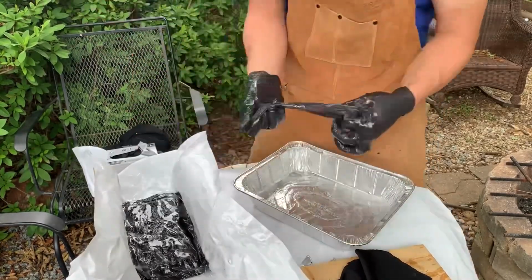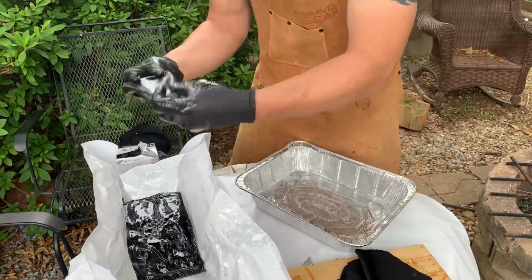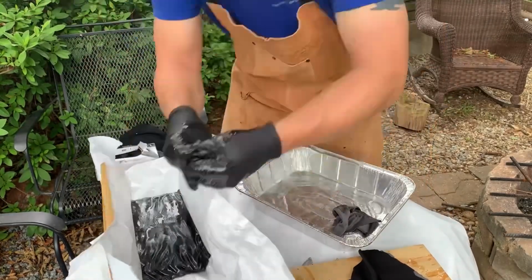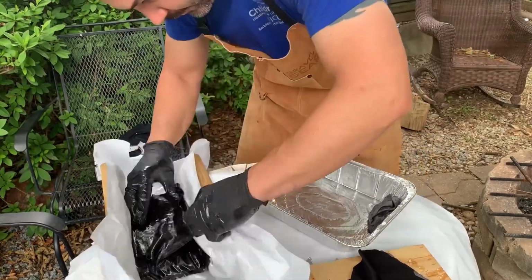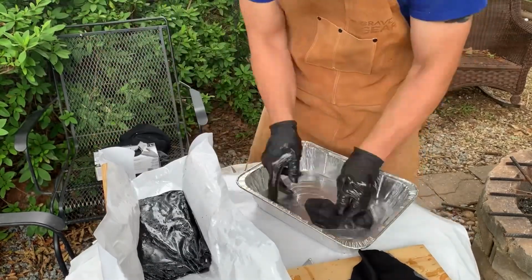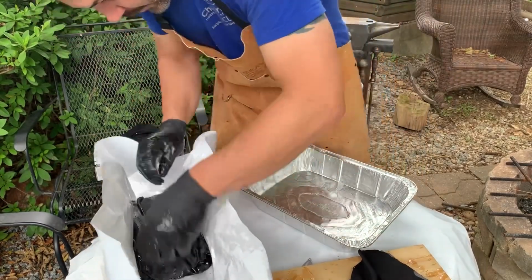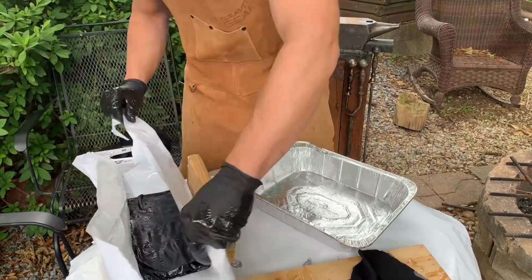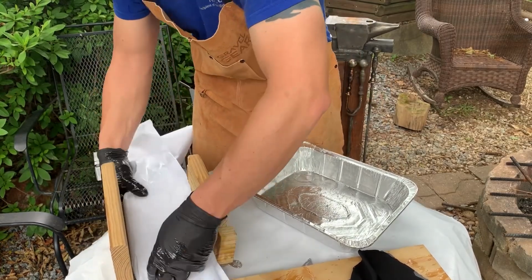On that note, one word of caution I want to give you guys on your color selections that I have realized in retrospect is that whatever colors you choose, they're going to get a few shades darker once they're saturated with epoxy, kind of like how a person's hair looks darker when it's wet. For me, that didn't spell disaster, but it just made it where the layers of gray didn't contrast quite as much as I wanted with the layers of black. So the next time I go black with gray, I'm probably just going to pick out a gray shirt that's a much lighter shade.